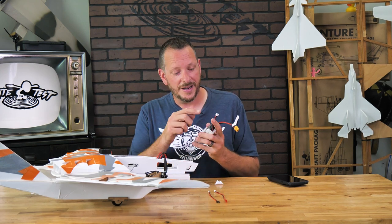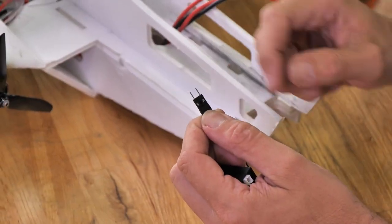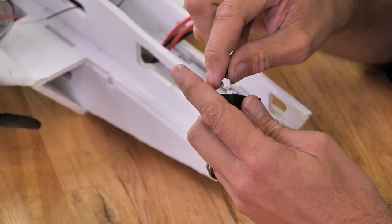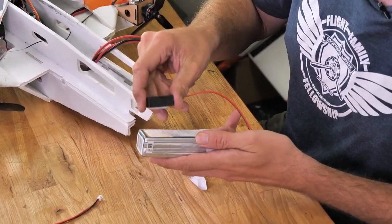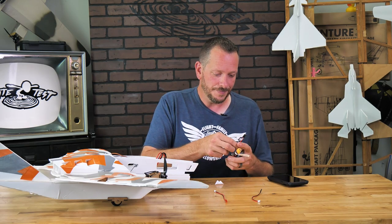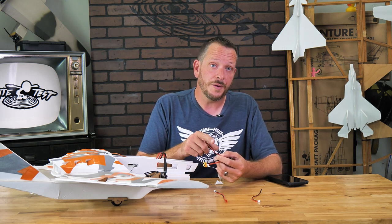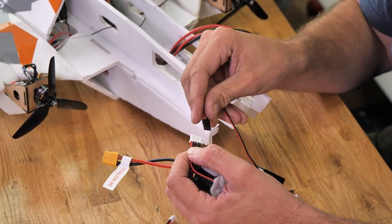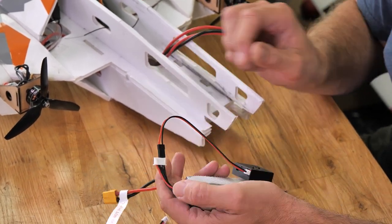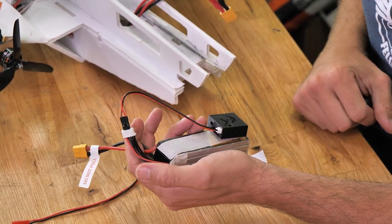Let's unplug this and next we'll show you how you can easily mount the FTEZ-ID to the top of your battery and utilize the power from your balance lead. Your balance lead connector looks a lot like a servo connector, but you're going to see two pins sticking out of it. This is where the reverse polarity protection is really important — all we need to do is simply plug this in. The balance lead will have one black wire followed with a whole bunch of red, or one red wire followed with a whole bunch of black. All we need to do is make sure we get in the general orientation, and we can plug it to any of these leads. If we plug it in backwards, there's not going to be any magic smoke — it's just simply not going to light up.